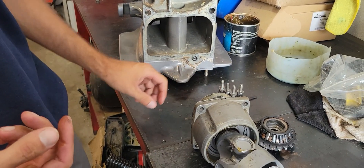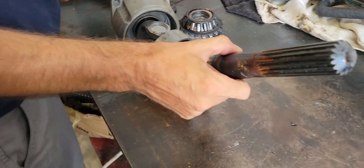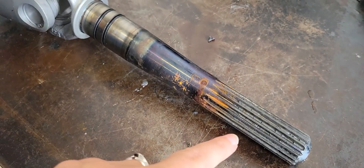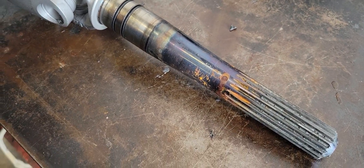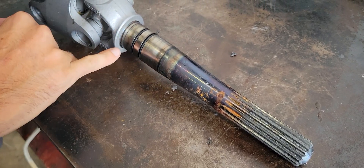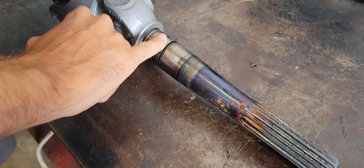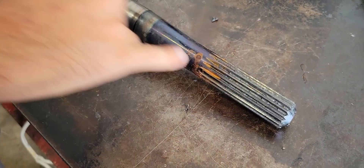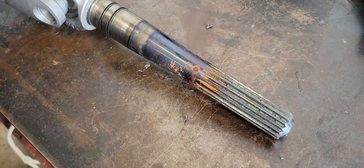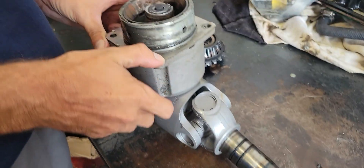There's been moisture and water present for quite a while — not just on your splines which go into the engine, but also the U-joints. As for the rust on here, the gimbal bearing rides right here on these O-rings, so everything from here forward is actually inside the engine bilge, at the rear of the engine. There's a little bit of surface rust — not perfect, but it's there.